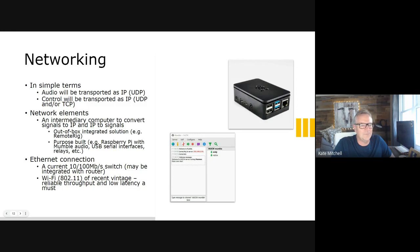That said, the 802.11 or the Wi-Fi in my IP-enabled solution is there to support a couple of AC Wi-Fi relays to turn power supplies off and on. These Kasa relays are readily available. I got mine from Amazon, dirt cheap. And in terms of latency, not a big concern whether that relay turns off 250 milliseconds later than when I commanded it to do so. But if you're sending CW and you need key down signals, a 250 millisecond delay might not be your idea of a good time, particularly in a contest.